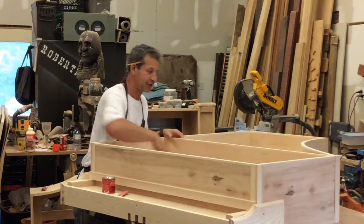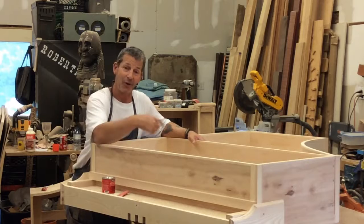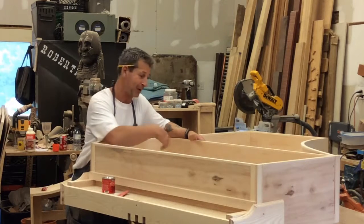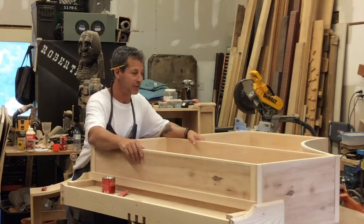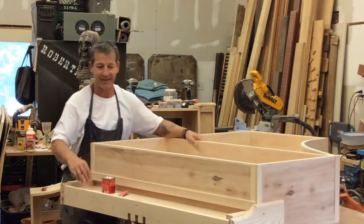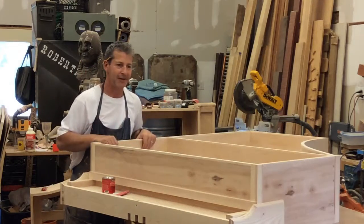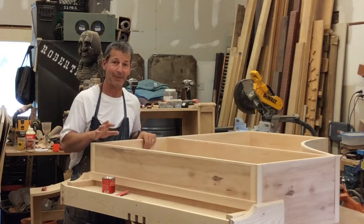But once all that's done, then I'll drill the holes for the adjustable shelving. I always do that after. I shouldn't say always. Once I drilled the holes prior to staining, and I live to regret it, because when I was staining and doing the polyurethane, I kept getting drips coming out of those holes. So now I do the whole thing first, then I'll drill it out for the adjustable shelving, then I'll install the piano keys and the locking hardware and the foot pedals and perhaps another one or two items off the original piano, but not many.